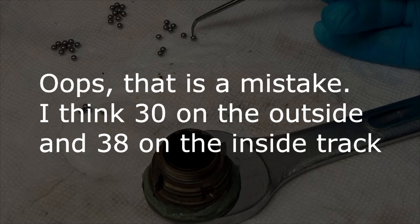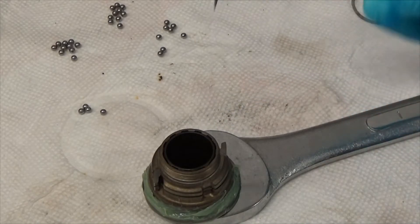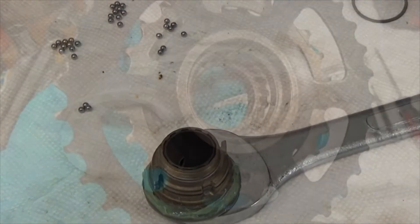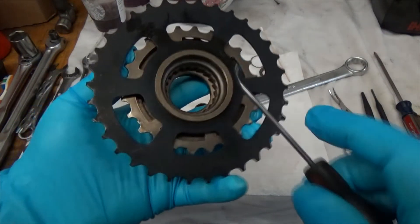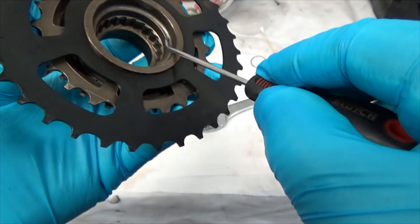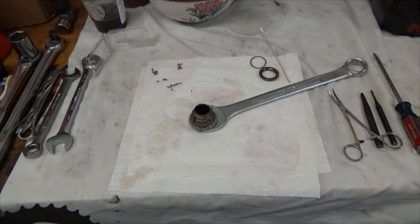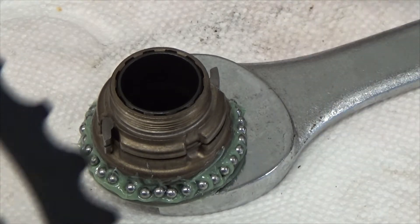My pick turns out to be magnetized, so I can pick them up one at a time and stick them in place — that's working out for me. I've got my 34 ball bearings counted out. When all the ball bearings are in place, we're going to cap it off. This is the race for the ball bearings. You could put a coating of grease on there but I really overloaded it, so as the ball bearings go around it'll all squish out and spread around.